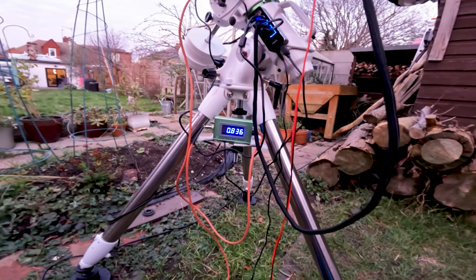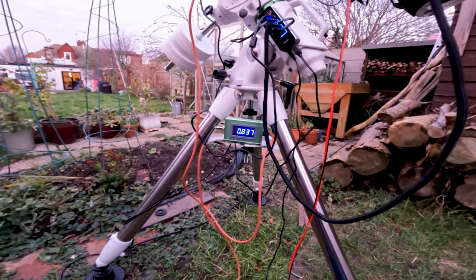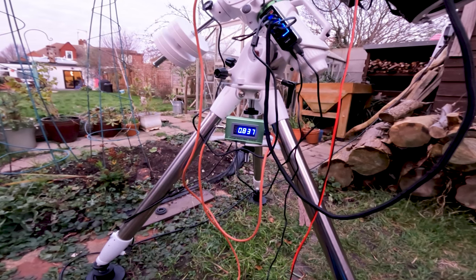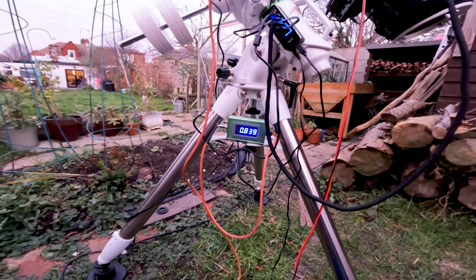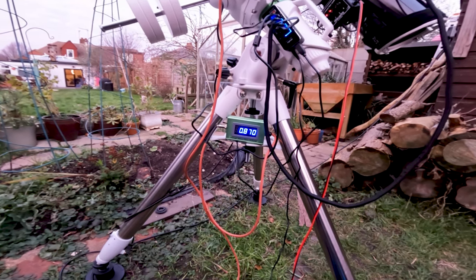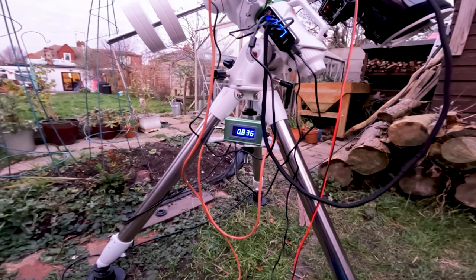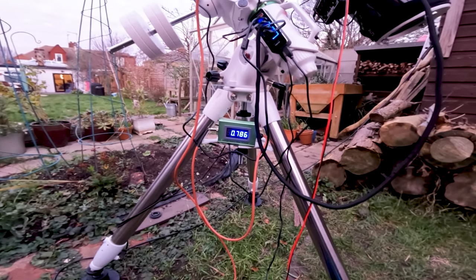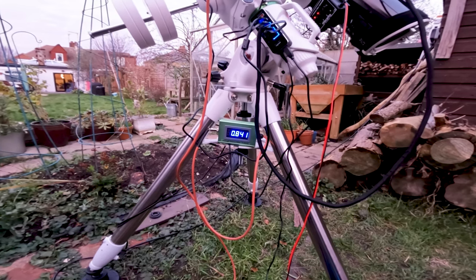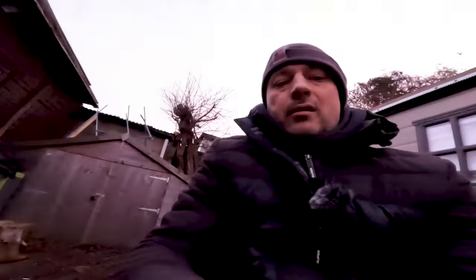At 8.3 - we've not got any movement on the point two now. If anything that's interesting because we've actually moved the worm in a little bit tighter and it's actually holding more stable than it was. That's a good sign. It's holding really nice - going to 8.4 there, oh 8.7 - do you see that jump up slightly? Let's come back - 8.6. So it looks like there might be a little tight point on the gears. It just goes from 8.4 to 9 - so that says to me we're at the point where it's just starting to bind, so I need to back it off a little bit.